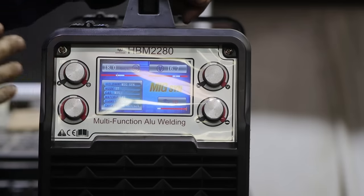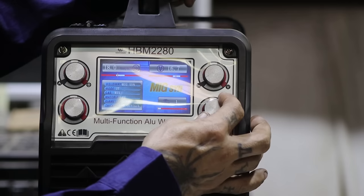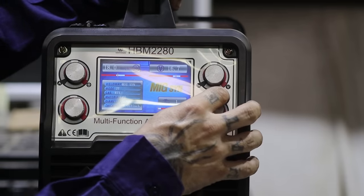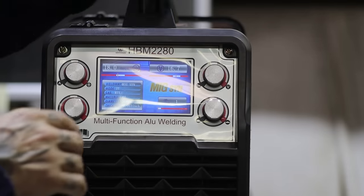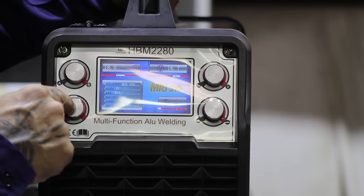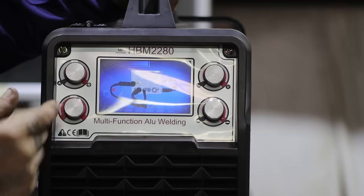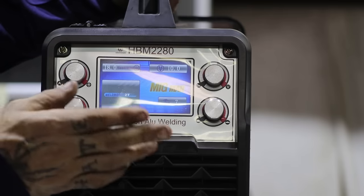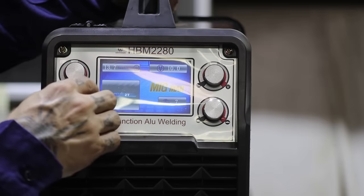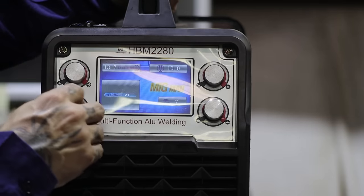I prefer to set my wire and my volts to how I weld. Down here you have your inductance, which is basically what your weld would look like. If you go lower it's going to have more of a bubble — a narrower weld width-wise. If you have your inductance up, it would be more flat and wider. You can hit this button again and switch it over to regular MIG — it's basically the same, 2T/4T again, but more basic. You've got your inductance, your volts and your wire speed. It doesn't have the recommended ranges for material thickness — you set it for what you think is right and go.